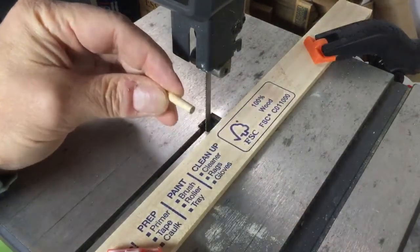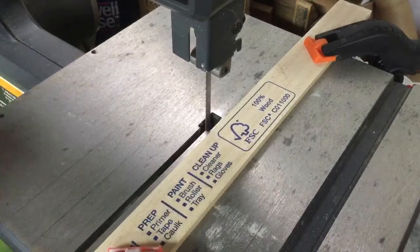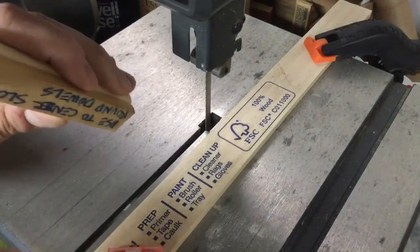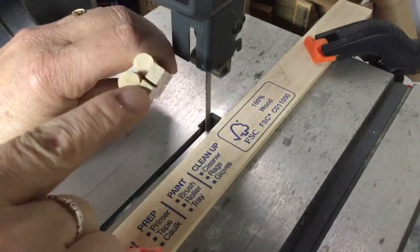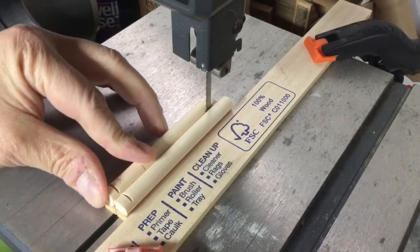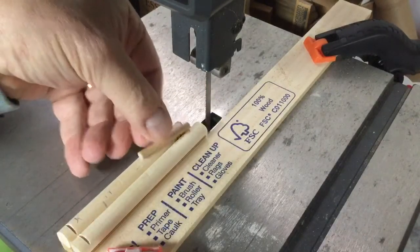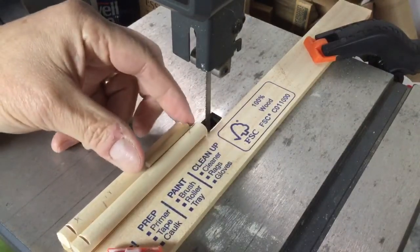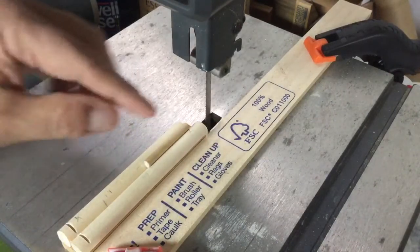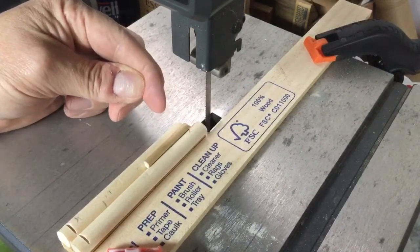The way that I cut that is I have a jig that I've rigged up along with this little slide edge here. The jig kind of looks like this — it's got two dowels on it and a bottom piece that has a slit cut into it, and that basically travels along this to slide right up into the blade of the bandsaw. When I get ready to cut, I set my dowel piece in between these other two dowels on the jig and I usually tape it across to hold it, and I've usually got a mark so I know how deep I need to go for a particular cutting.